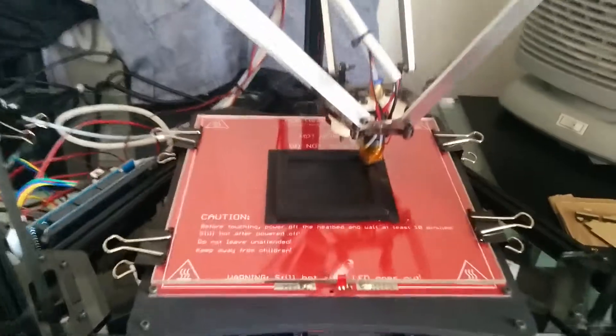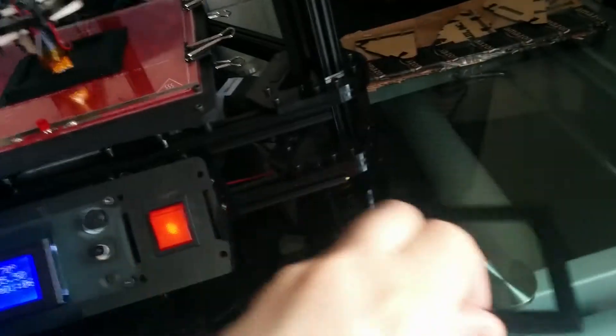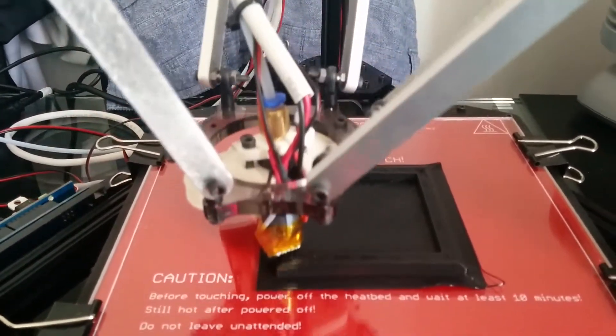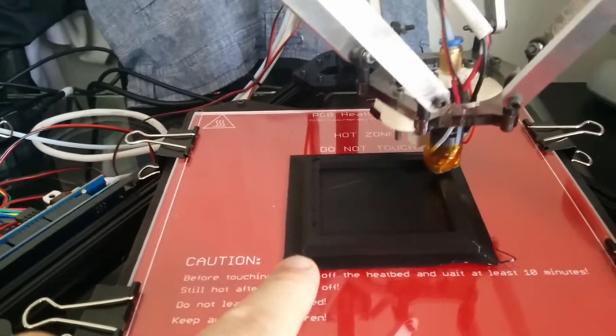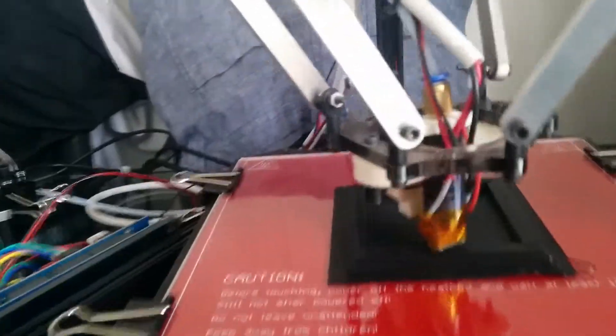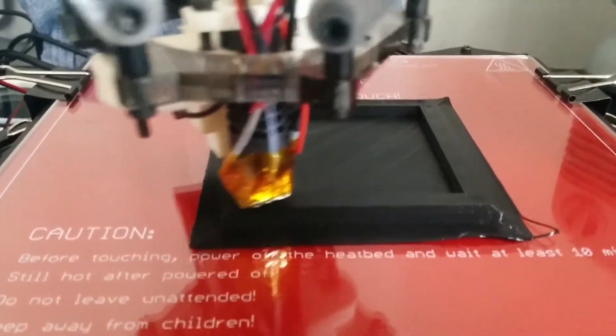This time there were two versions I discovered in the file. There was the hollow version of the base, and there was a solid version. I've printed the solid version because I think I'm going to use it as a pencil holder when it's finished. So having a base is important. I've also printed it with a brim this time to try and stop the warping on corners. You can see the brim has lifted slightly in that corner and also in that corner. But that's okay, because as long as the main structure doesn't warp, it's fine. The brim can do what it wants — it's going to be thrown away anyway.